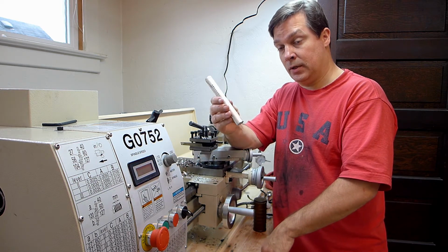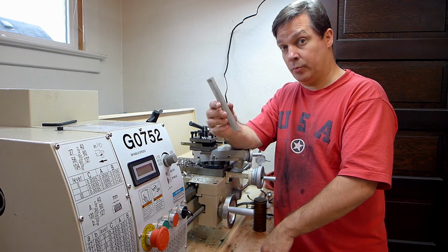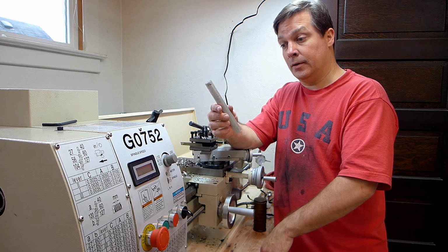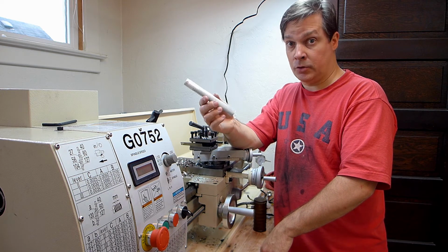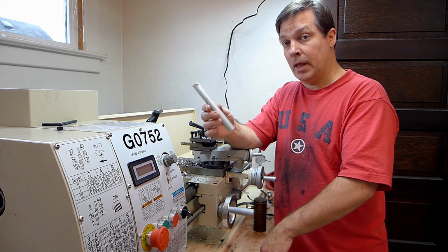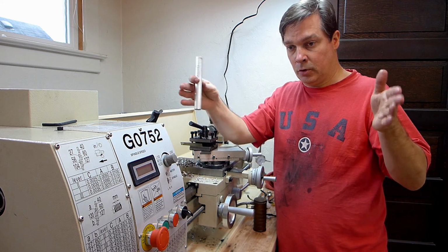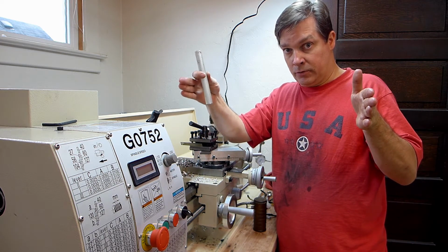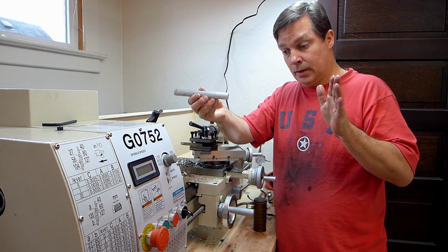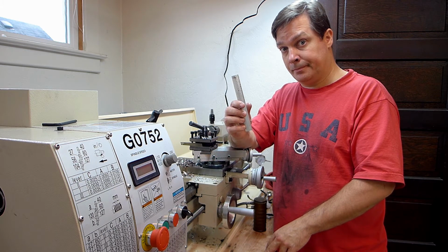And I need 20 of these. There are obviously then 10 compression tubes total in the wings. 3 in each upper wing. Those are a little bit wider wings. The wingspan is a little bit greater. And 2 in each lower wing. And there's one of these buttons on each end of the compression tube mounted to each spar, the front and rear spar, that the compression tube is aligned on. So that's the plan. Here we go.